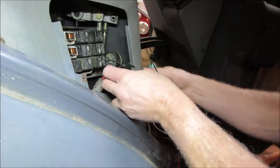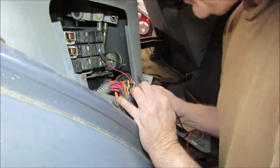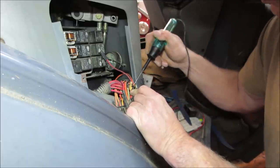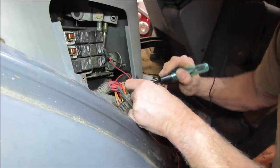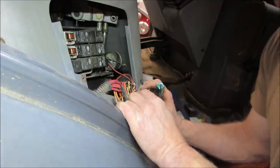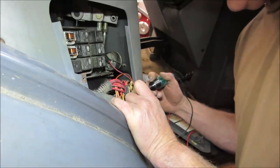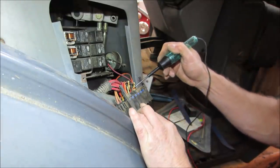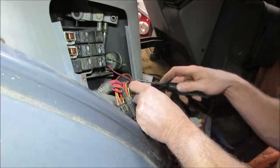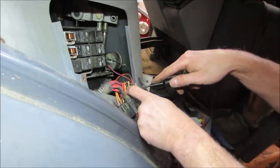I think we should probably disconnect the battery and kind of pick at this a little bit. I have a feeling that the fact that it's all cooked and melted like that is definitely going to be giving some of an issue. We're concerned about these two fuses right here, that's one of them. These two circuits are running off of that lead right there. That's the power probably coming in. And I wonder if it cooked something behind it. But that's our issue right there.